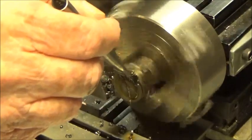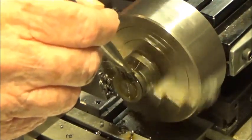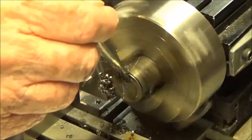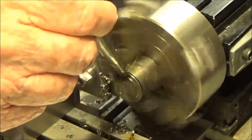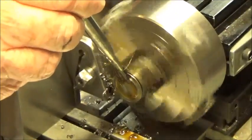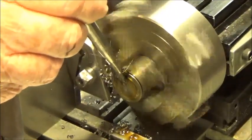It's a pretty good-sized chunk of steel to cut off on this little lathe. If you cut any piece of brass or aluminum off it, you don't even need to do anything — just run it through there. You can run it at high speed almost to cut those non-ferrous pieces of metal off. But for a piece of steel, you need the oil and the constant feed.